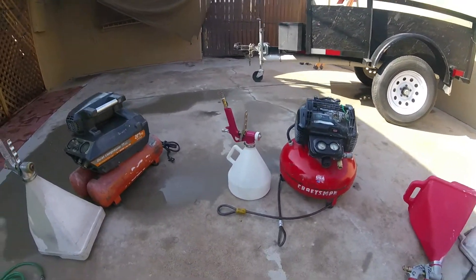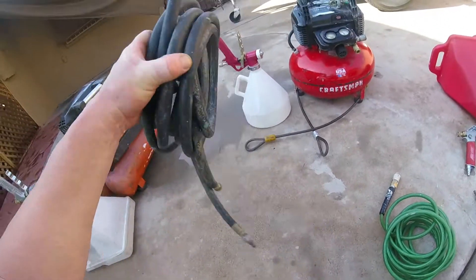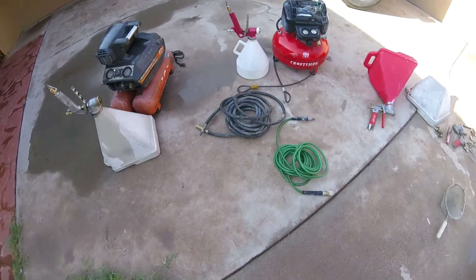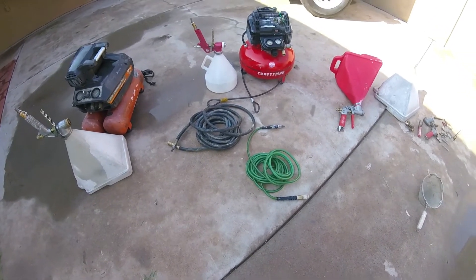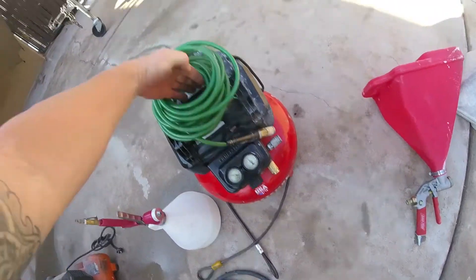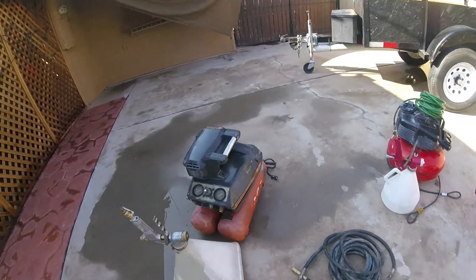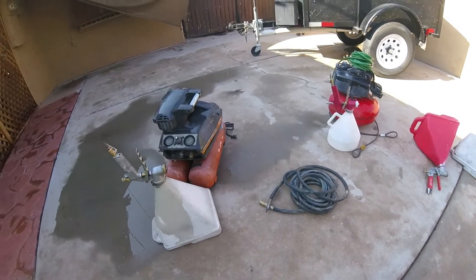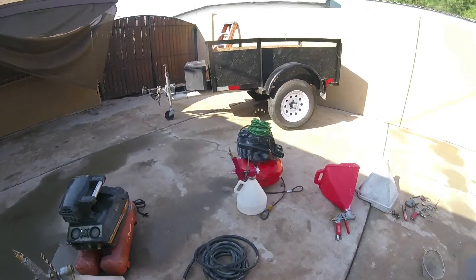For hoses, I like to use 25-foot air compressor hoses. This one I prefer — it's Goodyear, heavy duty, but it's heavy. I like these ones — they don't tangle and they're lightweight. The reason I like to use 25-foot hoses is because they don't get tangled and they're easier to braid up when you're done with the job. If I need to extend it to 50-foot, I'll just add two. It's easy to carry from room to room, especially when you're doing patchwork. If you're doing a larger job, maybe just set up in one room and run the hose throughout the house. But the bigger hoses get in the way — they get tangled and crimped as you're spraying. That's why I like to use the little hoses.